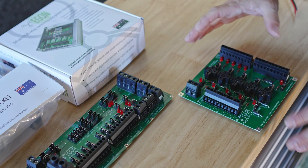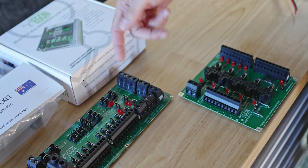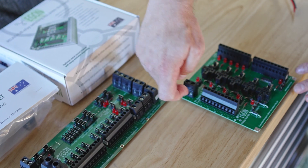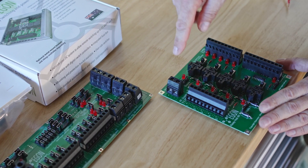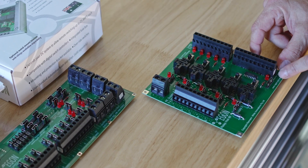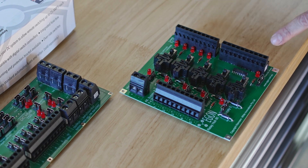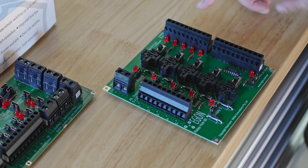The thing I love most about it is to use this as an extension for a power distribution system like the DC hub. So in a really big installation you get a power supply from your main power distribution into the power supply of the relay hub, and now the magic begins. You can put a fuse in here, switch this relay from this supply here with a multi-core cable, and you can have the output on this side here — switching the light from a switch, a remote control, or both.